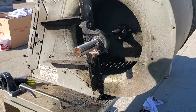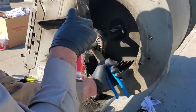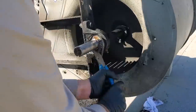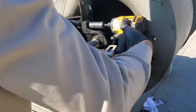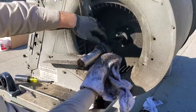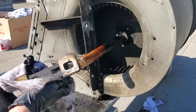There we go — I'm using the weight of the wheels and everything to spin it free. Now I can get some penetrating oil in there. This guy's loose. That thing should slide right off now. So if I was changing just this bearing, we'd be in luck and I wouldn't have to change the whole shaft and the blower wheels. But life happens — it slides right off. Cleanliness is your best friend. You can see the bearing seal had failed because there's grease coming out in one spot, or it was over-greased and it blew the seal out — that happens too.